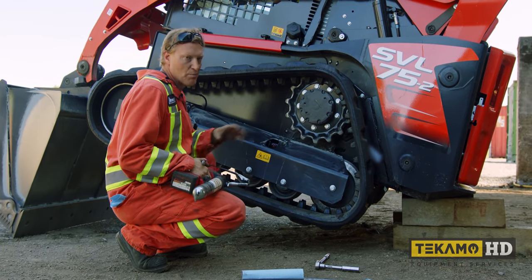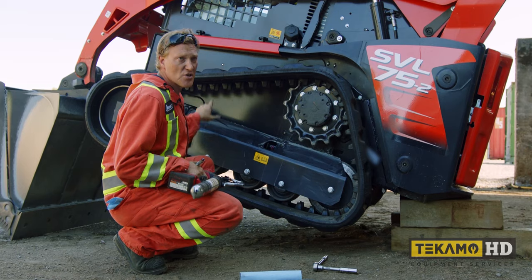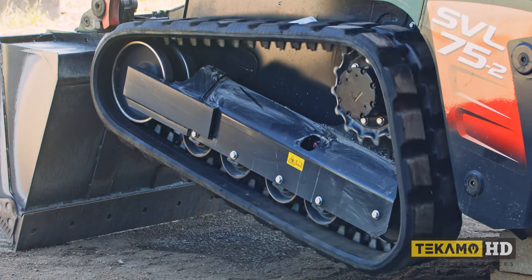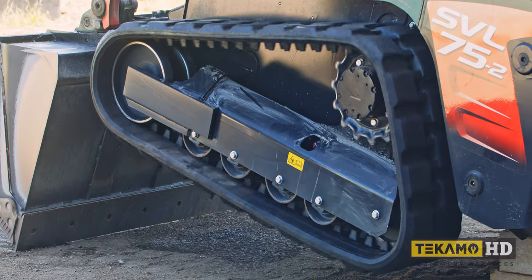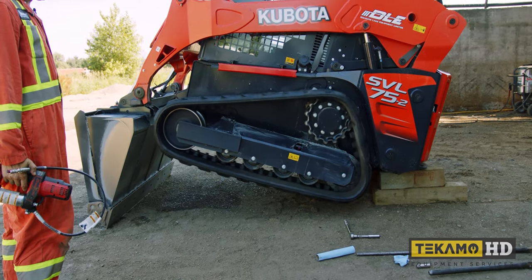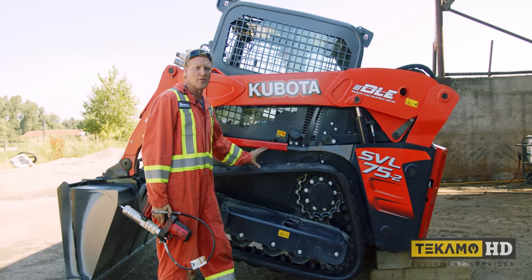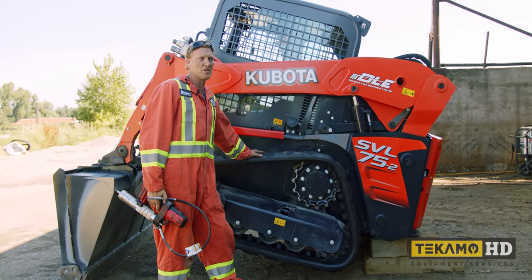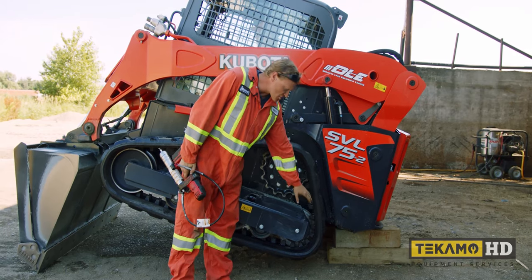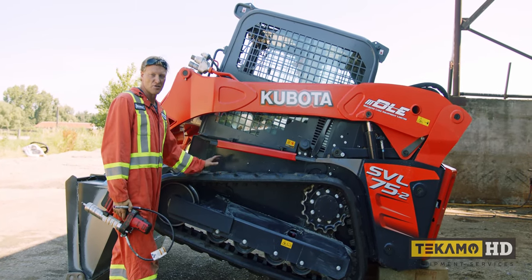When these tracks are new they're going to break in, but to initially adjust them I get them nice and tight — you can see there's not a lot of bounce. Get your operator to start the machine and travel the track forwards and reverse a little bit to let it settle in and bend to shape. The reason we move forwards and backwards: right now I'm in a clean environment, but on a job site you can have dirt, mud, snow and ice, or debris in between the sprocket, rear idler, or front idler and the track. That creates a bit of a gap, and once you start running it, that debris gets out and the track is loose again.